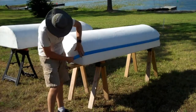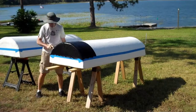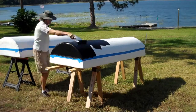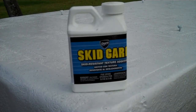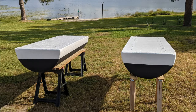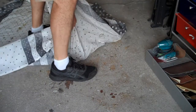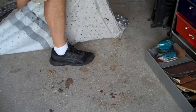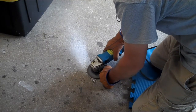As this pontoon boat will live in a lake, I'm using black bottom shield anti-fouling paint below the waterline. This is a copper-based ablative hull protection paint that will hopefully prohibit the growth of marine life on my pontoons. Above the waterline I'm using white Rust-Oleum topside paint. I used an anti-skid powder between the first and second layers of topside paint to give a bit of grip on the nose cone step. Now that I have two semi-matching pontoons, the next step will be to make fiberglass deck boards to bridge them. One final note: solid plastic shower curtains work great as drop cloths, but woven plastic cloth shower curtains sometimes allow epoxy resin to flow through, leaving epoxy and plastic cloth stuck to your garage floor. You definitely need a P100 respirator when grinding fiberglass and concrete.